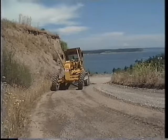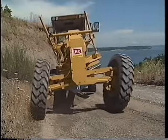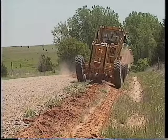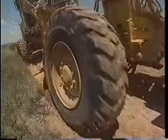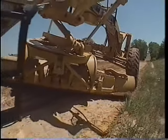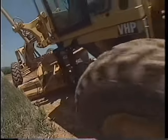If you're making a marking pass around a tight curve, do not lock the differential. Lean the top of the front wheels toward the heel of the moldboard, just enough to counteract the side draft. On the second pass, put the wheels in the marking pass to help hold the machine in line. Keep the heel raised to increase the depth of the cut. Once you've established the ditch line, you can increase your speed and depth on succeeding passes. While you're building and cleaning ditches, you may have to dispose of sod and excess soil. We'll cover a few of the disposal methods.